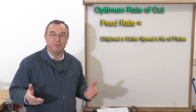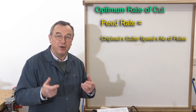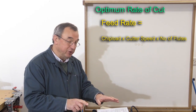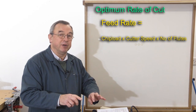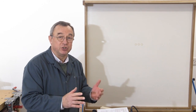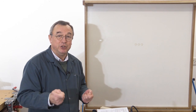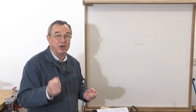This may not seem very important, but it is when doing CNC work. With a CNC, you don't have the close feedback you get when the router is in your hand or the wood is in your hand on a router table. In both those situations you can hear how the router's performing, feel whether there's vibration, and smell if there's burning — and make adjustments accordingly. But when using a machine guided by a computer program with preset parameters, this is where you need knowledge. That's where chip load comes in: knowing the chip load lets you judge what the feed rate should be, and also what the speed of the router or spindle should be.